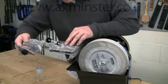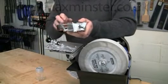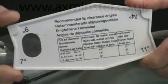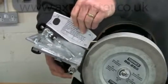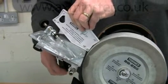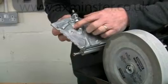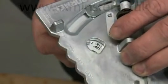With that alignment set, just do a quick check to make sure you haven't altered the amount of protrusion, and lock the drill bit up nice and tight. Now we need to set the clearance angle — this can vary depending on the diameter of the bit and the type of material you're going to be drilling, but there is a chart of recommendations on the side of the template. Most drills of this diameter for general purpose work need a clearance angle of 14 degrees, so tilt the plate until the two wings of the template at the 14-degree end just touch on the stone and lock it up tight. Point angle is nearly always 118 degrees — check this in the gauges on the side of the plate and set it with the scale, which goes from 150 degrees right round to 90 degrees.